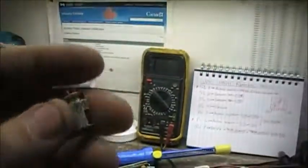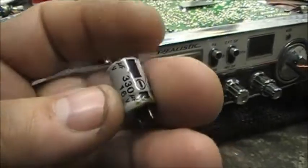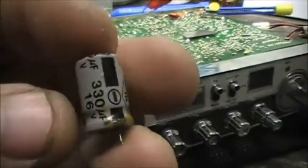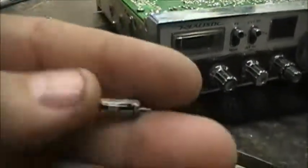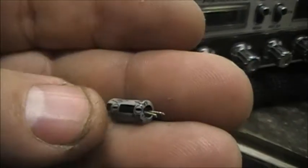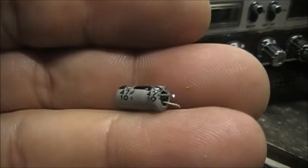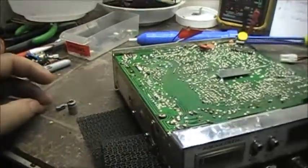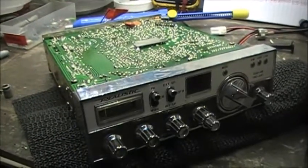That dead short is why I'm getting 6.7 volts across the speakers. We're going to put in a couple of new capacitors and replace this one. And since this other fellow is in the same circuit, he's probably already getting cranky too, so I'm going to replace both of these with new ones and see if we can get some life out of this thing — fingers crossed.